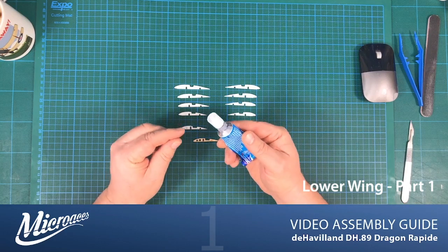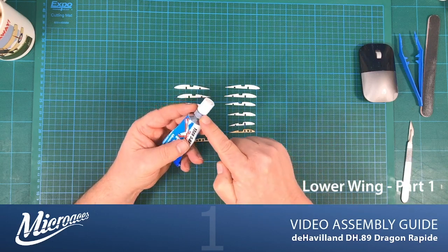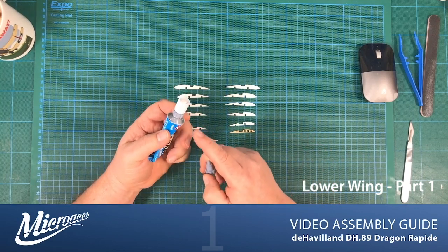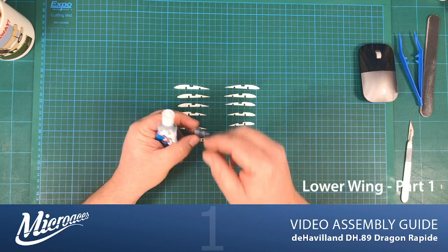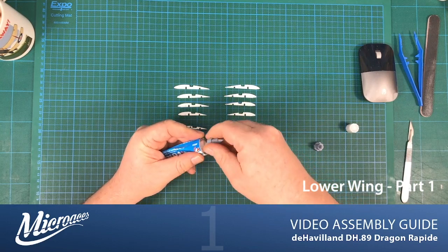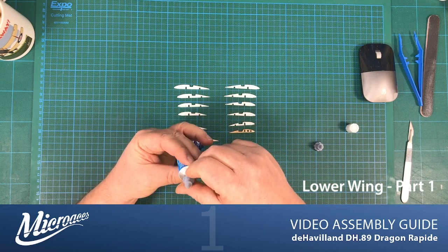Just wanted to show you something actually, if you haven't seen this before. One of our customers put together a 3D file for a nozzle that would increase the accuracy of the glue coming out of the foam to foam. Also, obviously, it reduces the amount that you need to use, so you're likely going to save on glue, and not put as much weight into the aircraft either. It's a great idea. We've modified it slightly. We've put a thread on it too, so that you can put the cap onto the nozzle itself. But if I take the nozzle off, you'll see that it sits directly over and covers the original nozzle with its very wide spout, and reduces that spout down to a couple of millimeters.